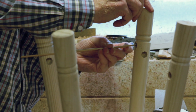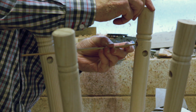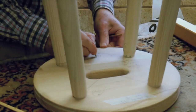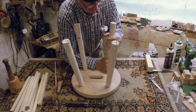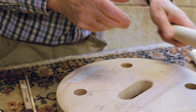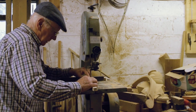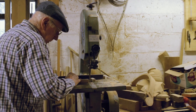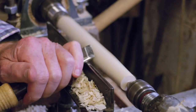The end of the ruler should be zeroed exactly. My right elbow and fingers spread the legs apart while the fingers of my left hand slide the dowel and ruler into the backs of the opposing sockets. Add 8 inches to the ruler measurement and write the measurement on the seat beneath. I cut crosshairs on one end for my drive. The skew chisel and adjustable sizer are used on the stretchers.